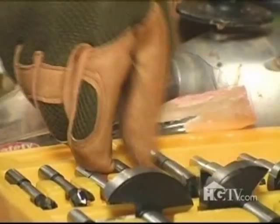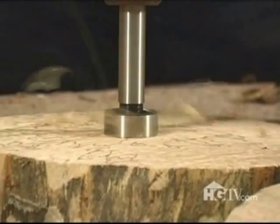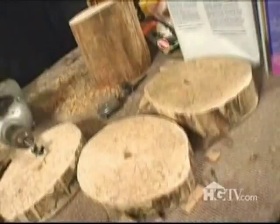I made pegs in two of the branch arms. The third arm requires a slightly different size hole. Now I need to change my drill bit so that I can put my holes in my pieces and finish it all up. I like using forstner bits — they make a nice, clean hole so that I can put my shelves on top of my branch.